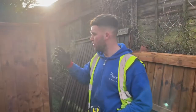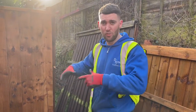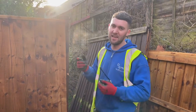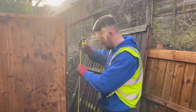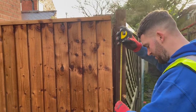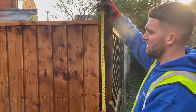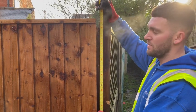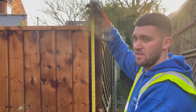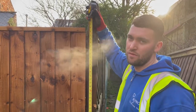We're ready for the corner now. Rather than planting the corner post in the hole and then it not being the right height and struggling to get it back out, just get your tape measure and measure down. It says eight foot there, so I know that post has got to go slightly up. I can just chuck some postcrete down there to get it to the right height, rather than struggling to get it out. Just measure and cut right the first time.